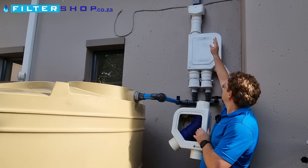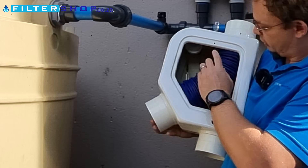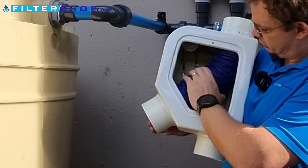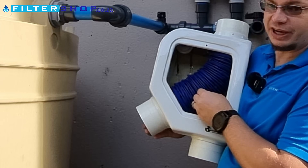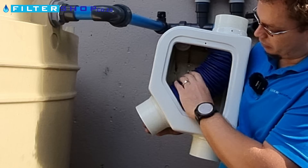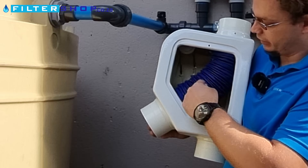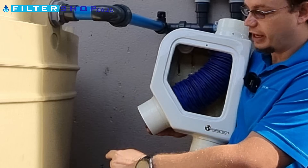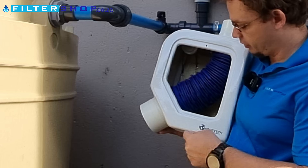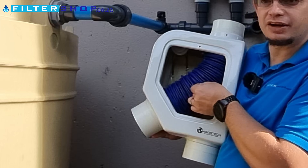Basically, you connect it in line coming down from the gutter and then it goes into this spring-loaded filter mechanism, which is on a pulley. As the water goes through, the can can move around, and then your leaves and twigs and dirt get shuffled along out and deposited on the ground, while all the water gets recovered through a filter in the side of the mesh.